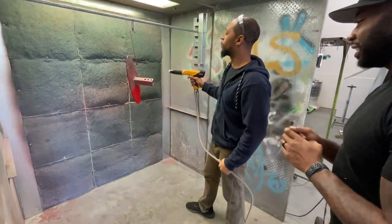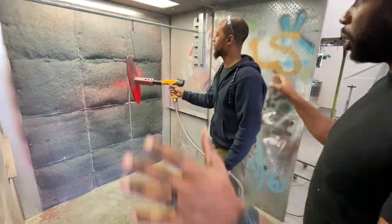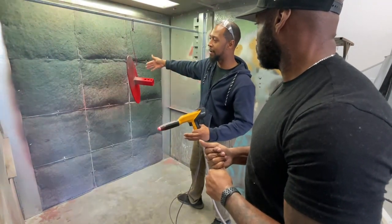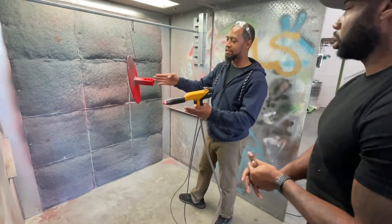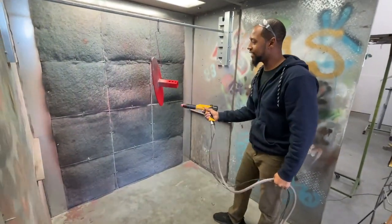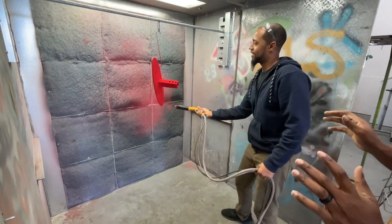Any techniques? It's similar to painting. One tip: start from the back and do the front last, so you can see how it's really covering. Start in the hardest places first — the inside. Try to coat everything inside too; it prevents rusting later. If you get too close it's going to push the powder out — it's called a Faraday cage effect, too charged in that area and it'll blow off.